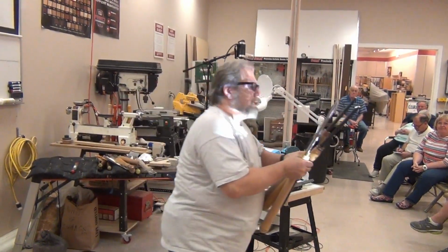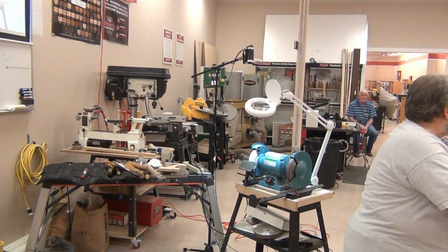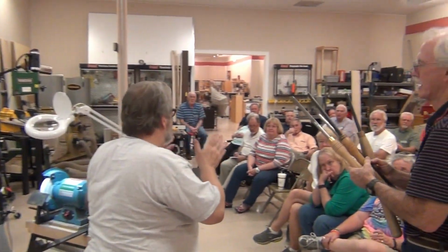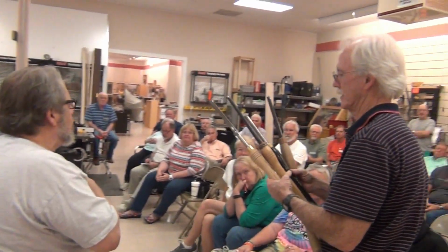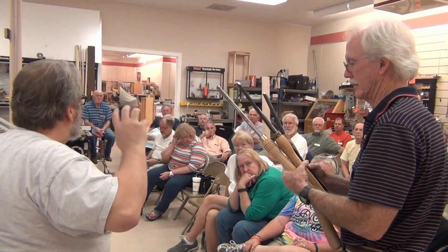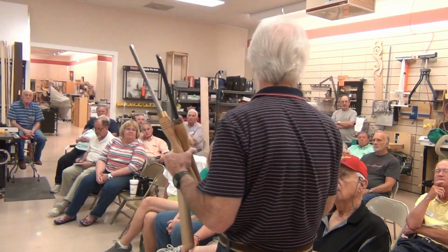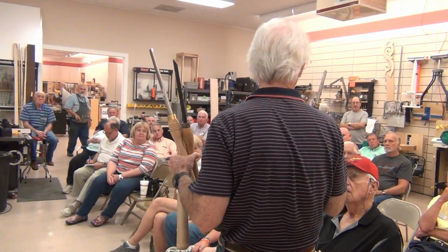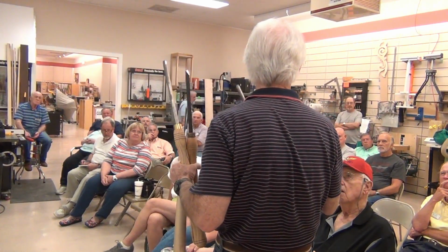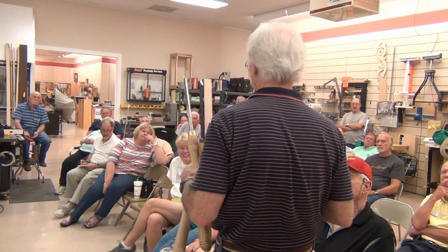Daniel, why don't you explain which is which to them while you're setting up? Setting up, yeah. Because we both have the same thing. He and I both have all three types that we sharpen with the same way, all right? So again, our edge geometry changes from gouge to gouge a little bit, and you can tell that. So the dark handle is a Crown stock, Ellsworth grind, right? So that's what Ellsworth said, this is parabolic. That's why I said different manufacturers claim that theirs is parabolic. But there's a variation here than the other folks.